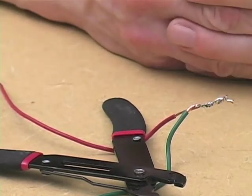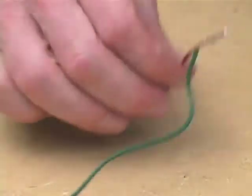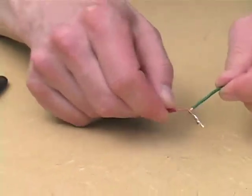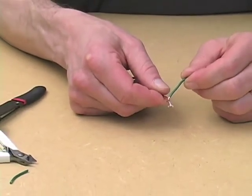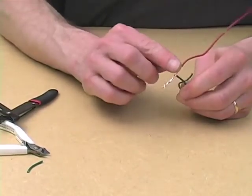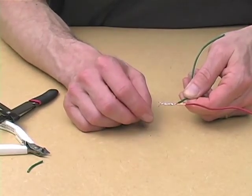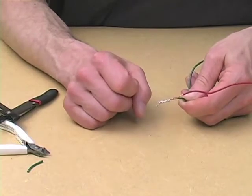You wait a moment for it to cool and harden, and then you should have a strong solder joint. A good solder joint is shiny silver and has a very smooth texture to it that reveals the underlying texture of the material, instead of being covered with blobs.